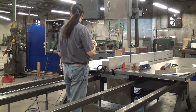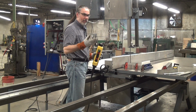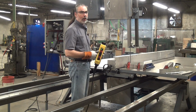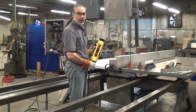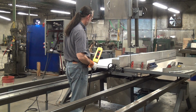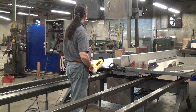I'm actually going a little faster than I thought I would there. And I mentioned that there is some concern about using a metal blade to cut metal and going too fast. I have actually seen sparks in my earlier test cuts from the blade cutting this material. So I know I'm eroding the blade more quickly than is ideal, but this is a worst case material, and it might be a better candidate for a hook tooth style blade instead of this special honeycomb style blade. So I'm going to go ahead and stop it. I broke my blade.